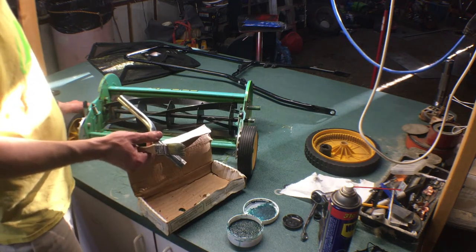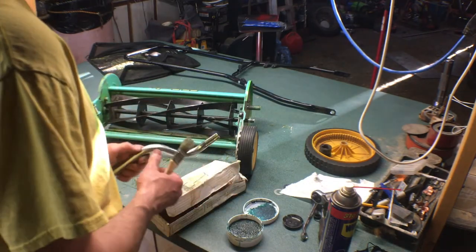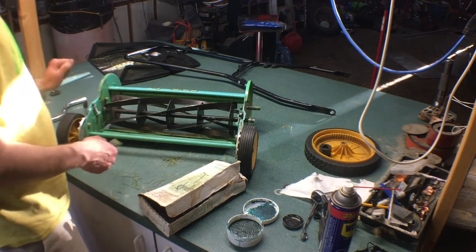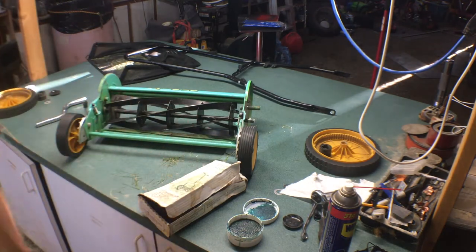This one's going to be a tough turner, so we'll probably want the handle anyway, and I usually get a piece of fabric and go. And we're just going to go ahead and slobber this on all the reel blades, and we'll run her backwards, because that's how you sharpen them, and we'll give it 7 minutes, and I'll see you in the 30-second montage.